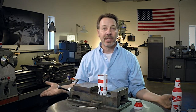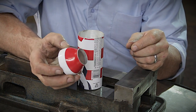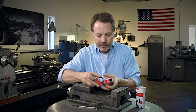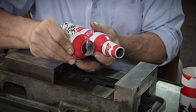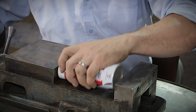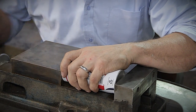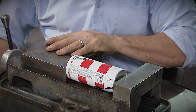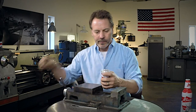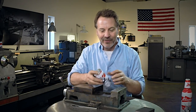Right now we could consider this finished, but I want to take it to another level — I'm going to add another baffle in there. You can see that I also cut the top of this off, and basically you can see I just cut it where the red line is. This is going to be my other baffle. We're going to force it in exactly the same way. Now there is a burr when you cut this on the bandsaw. Now we have a double baffle system.